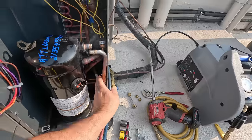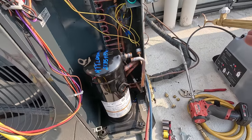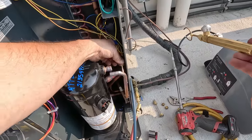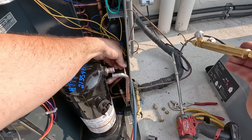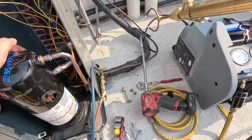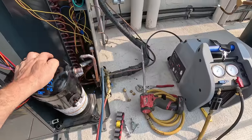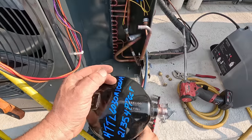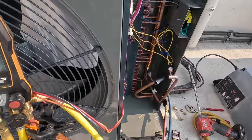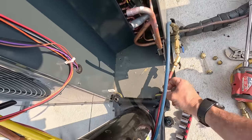I've said before you're supposed to cut it out - I don't do that unless I absolutely have to. That suction line looks like it may be a little pain in the butt. As far as getting too hot, I'm able to hold my hand on that pressure switch so it's obviously not too hot. Factory gave me no room to pull that out - a little bit of a bend on it. You call that piss-poor engineering - you can't get in there to do that. Could have loosened it possibly on the bottom but the way they hodgepodged that in there, it's kind of crappy too.